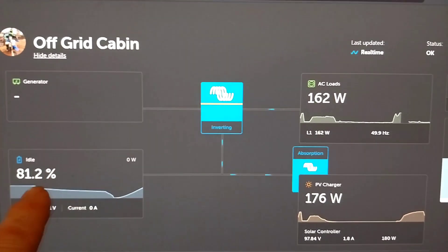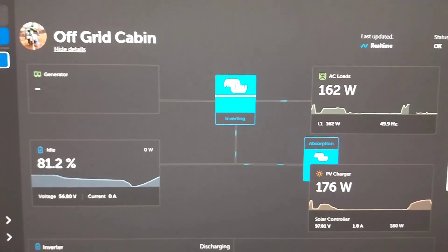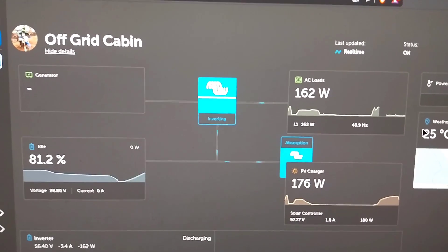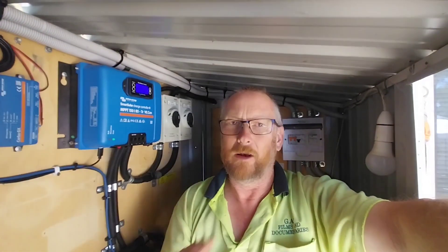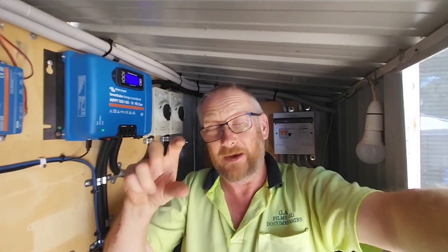81% and it's stopped putting power into the batteries. We've definitely got a problem somewhere if the batteries are only giving and taking around about 80% of their charge. That reversal of current flow right before the battery switched off to being fully charged is interesting. I wonder if that little reversal is causing our high DC ripple — just that little anomaly that we just saw.